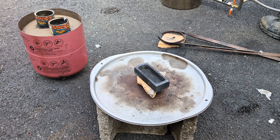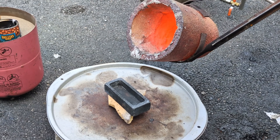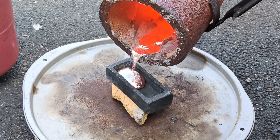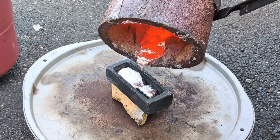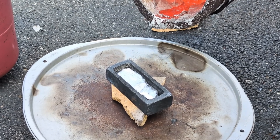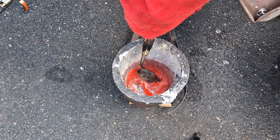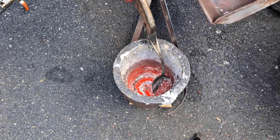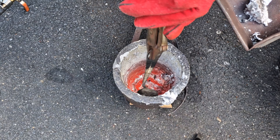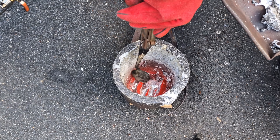I have a little bit of aluminum left over so I'm just going to pour the remainder into a small graphite ingot mold. I still have a little bit of molten metal inside this crucible but the dross in here is stopping it from flowing out, so I'm just going to try to remove some of the dross using a spoon from the crucible to try to pour out the rest of the aluminum.